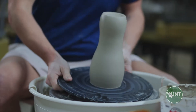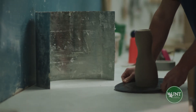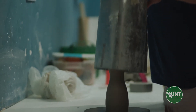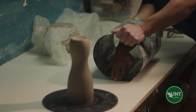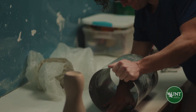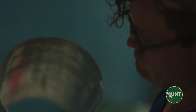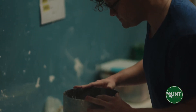Once we've finished with our prototype, we'll prepare for the mold-making process. We'll take metal flashing or metal walls, and those will ultimately be the thing that contains the plaster as we pour it. We will make a ring out of this metal flashing, secure it with duct tape, and then place it around the form. We want the distance between the prototype and the metal walls to be at least an inch, although two inches is a bit more ideal because it gives you more room to work.